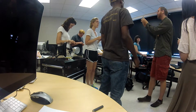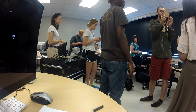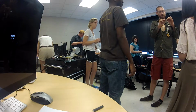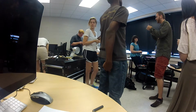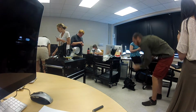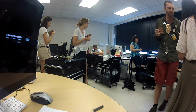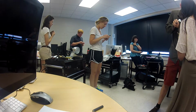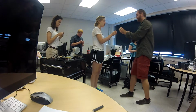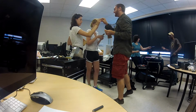So then I know exactly where those are going to be, right? Do you have a preference if they should be west and east or north and south? Your chip? The legs. Your chip has a little notch taken out of the top. Everybody see the little notch? The notch is up. So make sure that it points upwards. Exactly, so that's up.